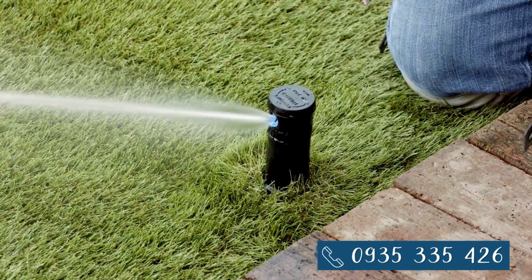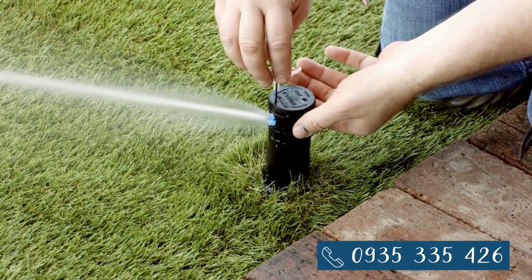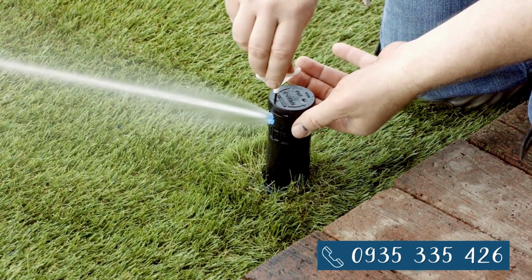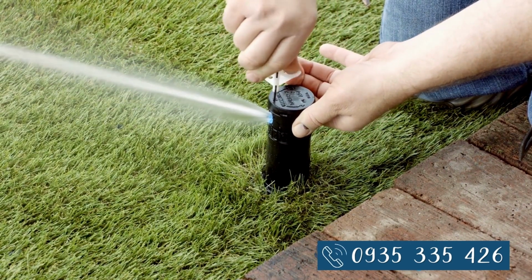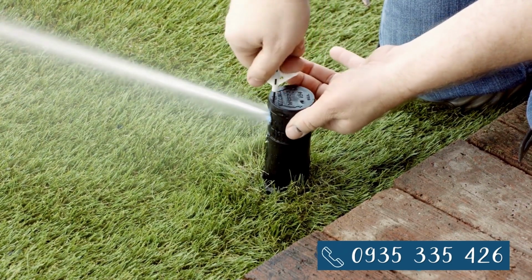And turn on the water. Use the raised adjustment screw to set your watering distance. You want the water to reach the next rotor over. Even if you do want the maximum watering distance, still have the screw down far enough to diffuse the stream of water.